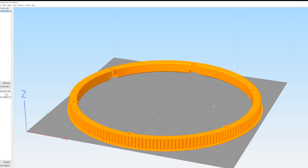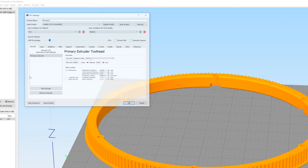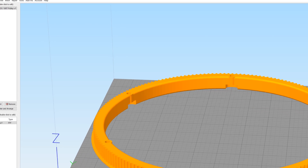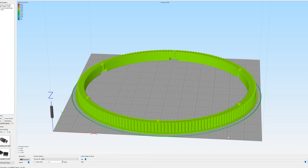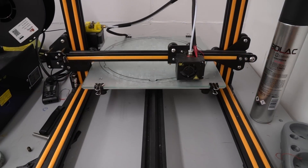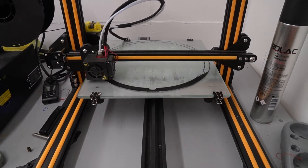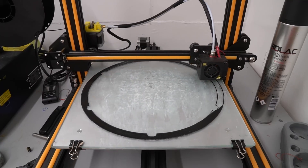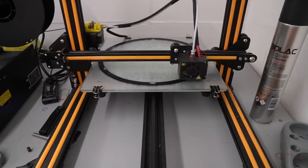In terms of printing, there are two main settings required to achieve a good tooth to belt fit. Number one is to print with only two outer walls, and number two is to print these two walls with the outer wall first. You also need to have a pretty well tuned printer for a pulley of this size, because if the belt doesn't fit properly it can cause all sorts of issues. Once I was happy with the design, I proceeded to print the pulley ring using PETG plastic from my filament sponsor 3D Prints UK, with 50% infill to make sure it was strong enough to hold its shape once on the bike.